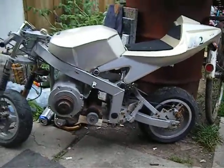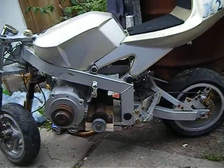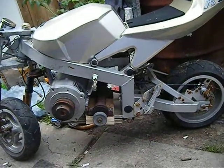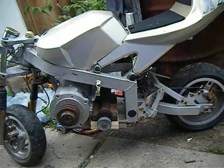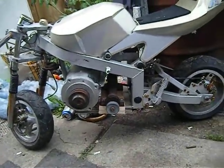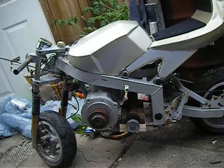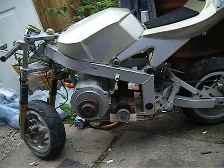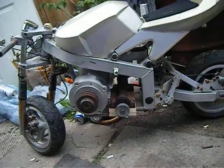Should look pretty good when it's done. Got the chain all hooked up — it's just screwed on right now with wood screws, so those are gonna have to change. I'm probably going to put thicker lag bolts in. There's a metal plate underneath, and if I can I'll put two bolts on the sprocket side right through the metal, which ought to hold it in place really well.